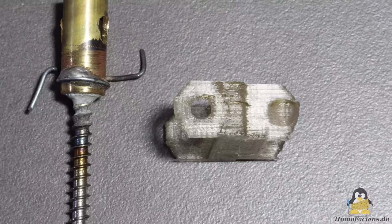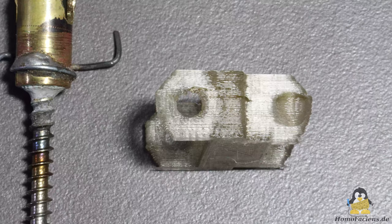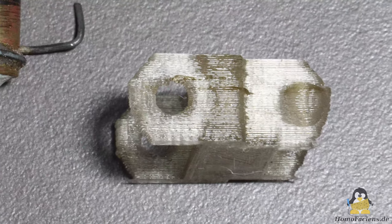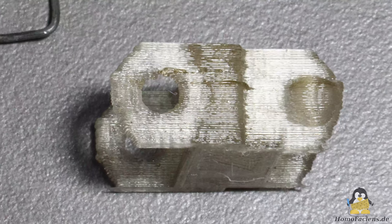The deeper the screw goes, the more noticeable the not so good runout becomes, as sometimes more, sometimes less material is extruded while the auger wobbles around. However, if the screw goes not deep enough, the material will not be pulled out of the extruder during retraction.